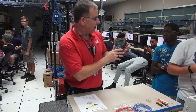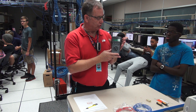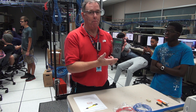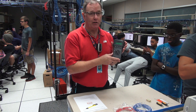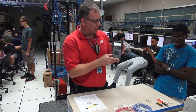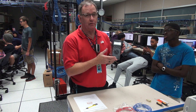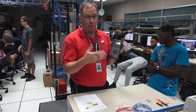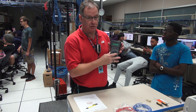The next setting is called CAL to cable. This meter uses TDR — Time Domain Reflectometry — to measure the length. It sends a signal down the cable and measures the time from when it's sent to when it's returned, and it calculates the distance. Different manufacturers' cables have different characteristics, so if you really want to be accurate with that measurement, you need to cut a hundred-foot length of cable and plug it into this meter and calibrate it to that particular box of cable you're working with.